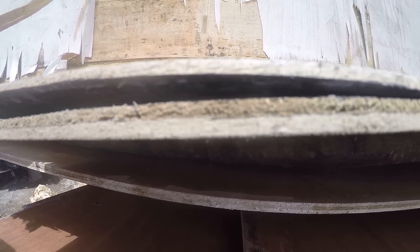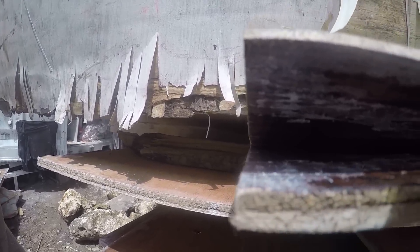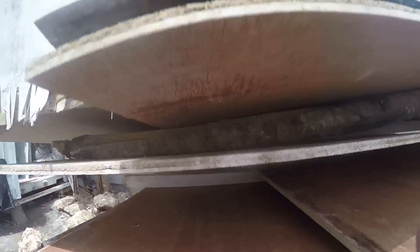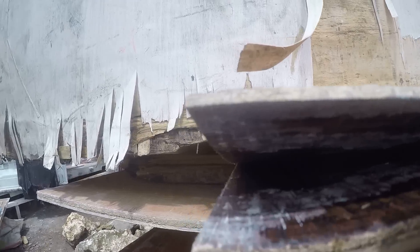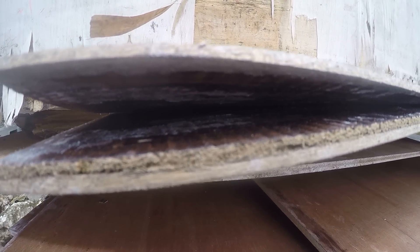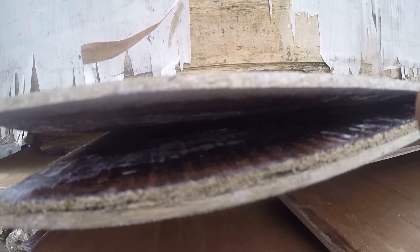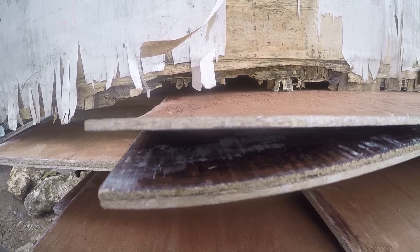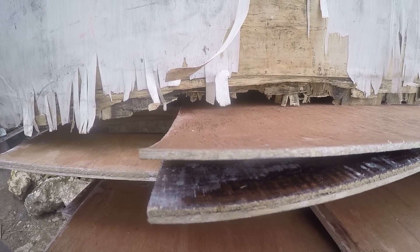Now we're going to the next quality of plywood — this is called marine plywood exterior. It has what looks like a mahogany veneer. This is what happened in one night of getting wet. After I painted the edges with an oil-based paint, the veneer on this piece of marine plywood blew up. This is seven-sixteenths — or half inch — marine quality plywood.